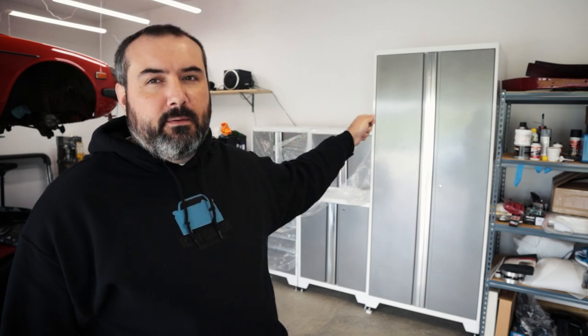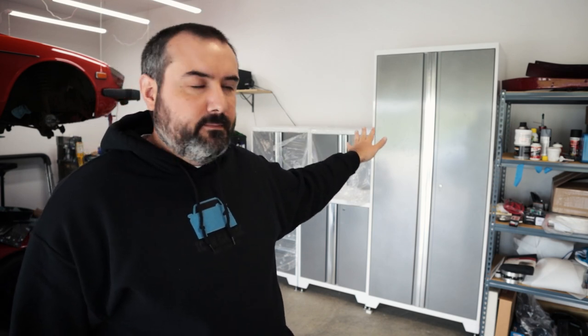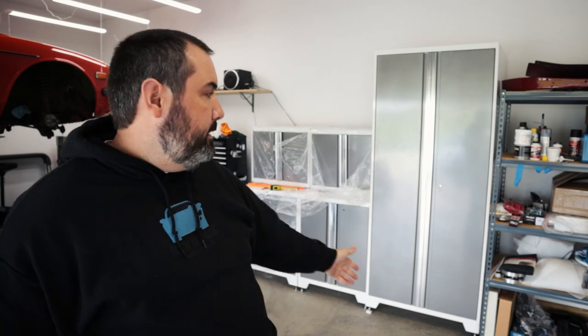I have made a decision on actually removing the baseboard to make sure these get pushed all the way back, because I took a level and I don't think my walls are very level either. So I'm going to have to do some shimming and some adjustments to get everything happy. And really, I think the biggest task is going to be mounting the upper cabinets, just because I've got to get those up there, get them all aligned, leveled, and all that good stuff. So I'm going to go ahead and move these away from the wall, and then I've got to make some marks on where I want to cut that baseboard, and then once I've got that cut, I can put everything right back.